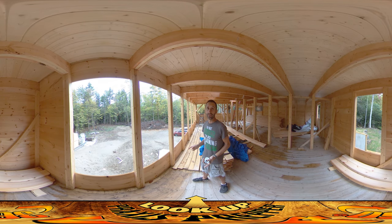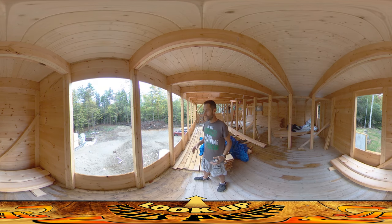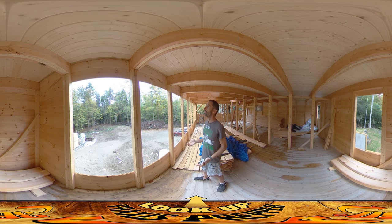What I'm working on today is preparing to get foam insulation on this front southern wall. I did the northern wall over there just the other day. Before we can really do the roof, we have to get the two sides up, so that way the foam insulation on the roof can kind of overhang that. If there was ever a roof leak, it'll help to direct water out instead of just down right into the roof. So I'm working on these today, and in particular I'm getting the windows all prepped.